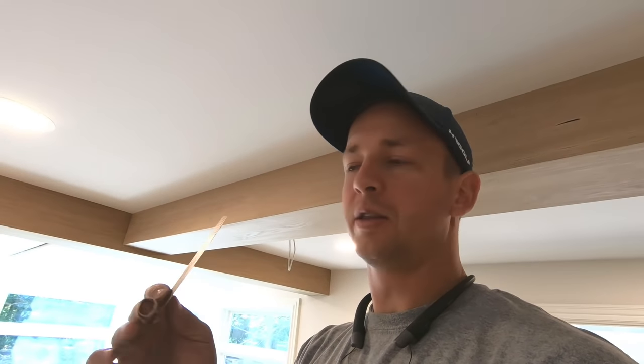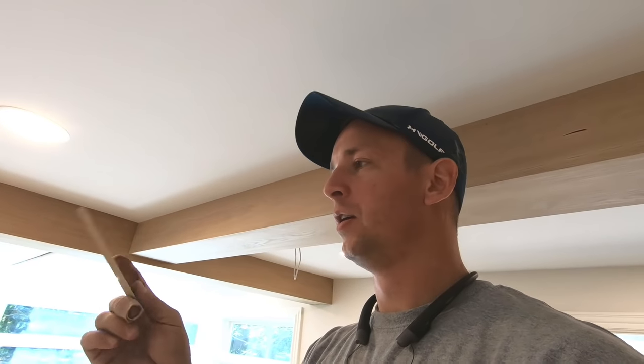These stave shims are the equivalent of stain grade caulk for stain grade work. It fills gaps. Any mistakes that you might make, they come in extremely handy. Very good trick to have. Just tilt your table saw over to 5 degrees to cut these out of some 1x, really easy to make.